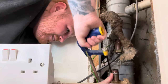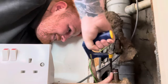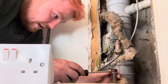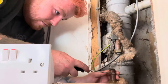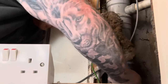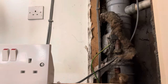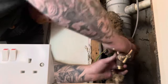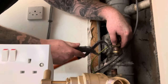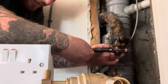So as you can see, I'm going to try it on the nuts and rings and I'm going to realise that this is not working. You've got two options: you either use olive pullers that will pull the rings off, but unfortunately the rings are really clamped down and I think it would cause more damage to the pipe, and I don't want any extra fittings in here. Sometimes on the brass olives you can actually get your grips around them and slip the rings off, but unfortunately they're too tight and clamped on — I'm not going to get it.